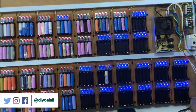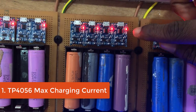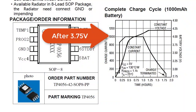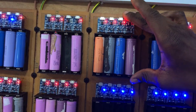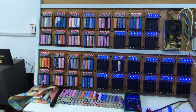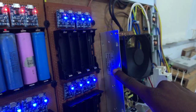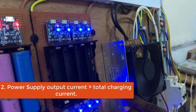If you want to build a battery charging station like this, keep a few things in mind. First, all these TP4056 battery modules have a max charging current. If the programming resistor is set to 1 amp, the module will charge at a peak of 1 amp. With four batteries on one pack that's 4 amps. If you have 150 of them charging at any point, you could be drawing 150 amps total from the system — so you need a power supply rated for at least 200 amps to allow some tolerance.